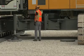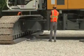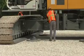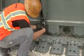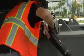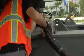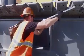Afterwards, the cylinders can be completely retracted and folded in. Now, switch off the machine and remove the lifting chains from the crawler track pads. Then, connect the hydraulic lines between the crawlers and the undercarriage via quick connections. Subsequently, the mechanical wedging of the undercarriage is carried out.